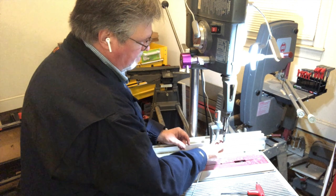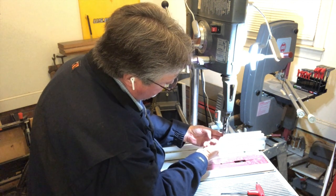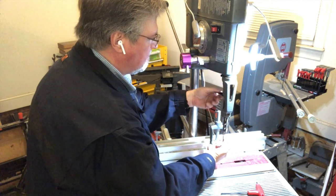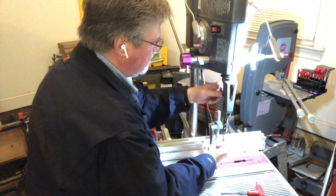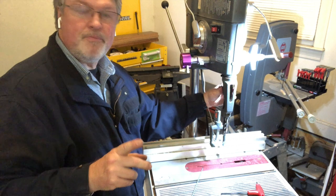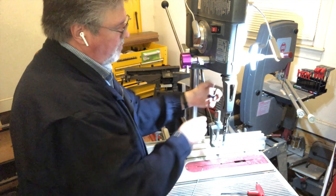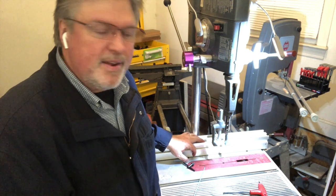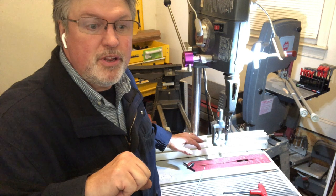Now, the lock is holding the chisel in place, not the bit. I want that flat lifting surface almost flush with the chisel tips, so I'll just hold that in place and tighten my chuck. Go ahead and tighten all three points on the chuck. I remember thinking that was garbage, but an engineer friend told me to try it — and eventually on one of those attempts, that third tightening actually did something. It will also tell you if your bit is perfectly centered in the chuck. Good habit to get into.